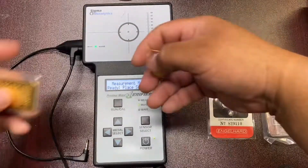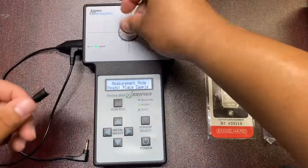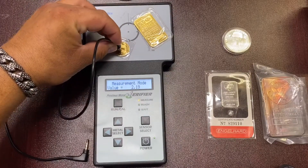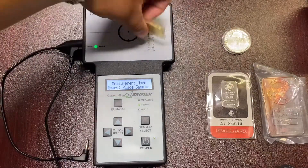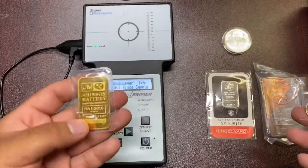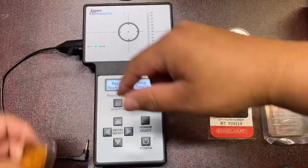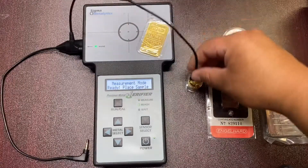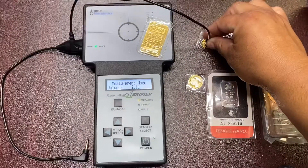It's a lot harder to calibrate such a small piece on there. You don't want to hold it too much because if you warm it up or cool it, it changes the number. The best way: if you're testing and you have silver and gold on hand, always keep a piece you know is real — maybe one that's been X-rayed — and compare the number you get, which is around 2.16 to 2.19. Here's a one-tenth ounce — reading 2.11.